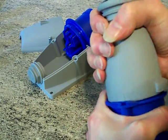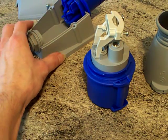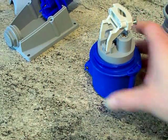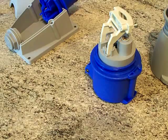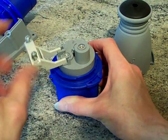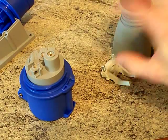There we go — we've got that open. Inside there is the cover and there are our sockets. Now then, the cord clamp: turn the cord clamp down like so, then pull it — the cord clamp is now released. Keep that with that and put it to one side.